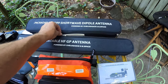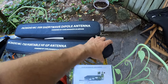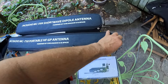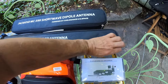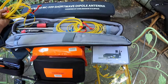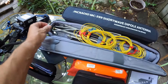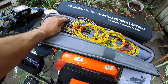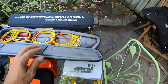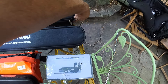The MCC 750 — this is the vertical that everybody's familiar with. It's been on the market for a while, it's a great seller. The reason it sells well is it's all laid out right: beautiful case, pockets for everything, 40-meter coil, wires, telescopic whip, ground rod, base rod. I made some adapters for it — they also sell adapters. I put some ground stakes in here for the counterpoise, and then there's the connector assembly itself.